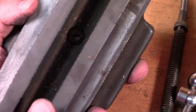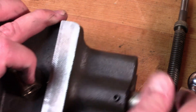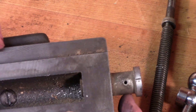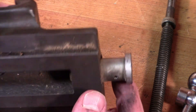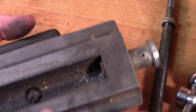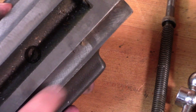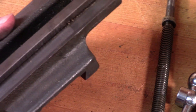There's a screw down here that holds the bronze feed screw nut, so I'll remove that — though it's just spinning on me, so I'm probably going to have to put that in a vise to remove it. As for removing this collar, there is an Allen set screw here which I've already loosened. It's in there pretty tight so I may have to press that out, or I may not have to take it out at all if I can just clean it up. So I'm going to go ahead and get these parts all cleaned up, take the feed screw off the other slide following the same procedure. You can see there's a lot of grime and it's just been sitting for years, so I'll get these cleaned up and we'll put it back together in the second part of this video.